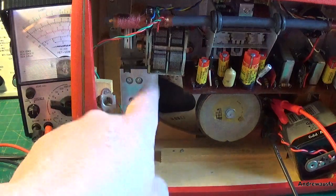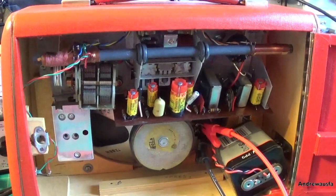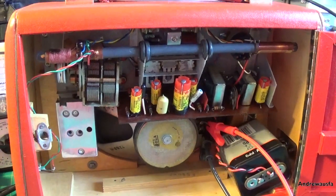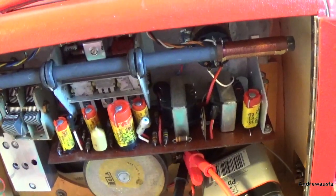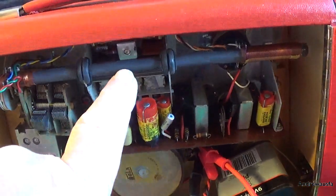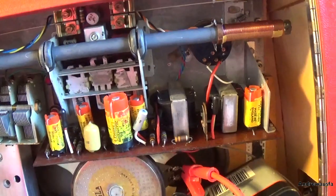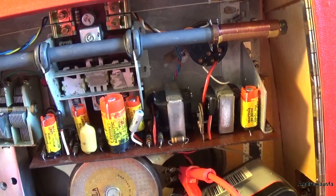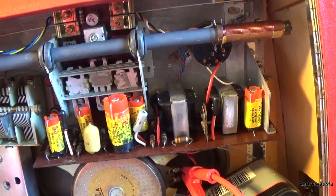So I actually untwiddled these, so I took it off the IF, so we should be having a super sensitive radio now. And I've turned the set down so you don't hear anything. So up inside here there are some brass screws. You can't really see. Let me tip the radio up a little bit. There are 2 pairs of brass screws there which you do the actual dial alignment and the tracking on.